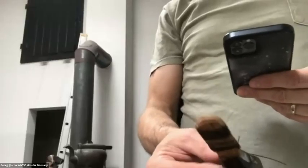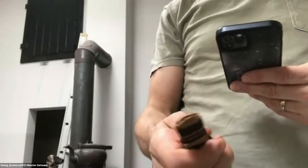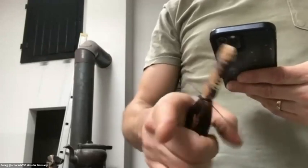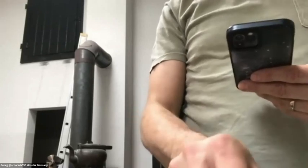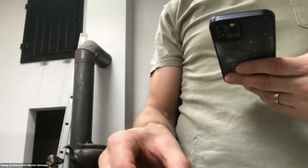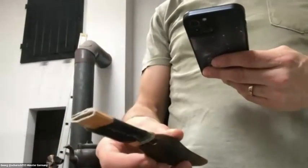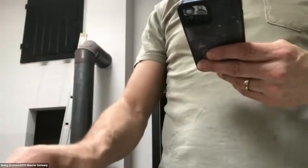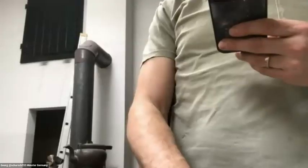This is a handle, for example, which is really asymmetric, but I took this piece of wood in my hand and thought, okay, here I usually have my thumb, so I just cut away this, and when I hold it like this, my hand fits in like that. So it's sort of an ugly looking handle, but it's actually quite comfortable. Then I played around with a Mora style octagonal one. Here another octagonal one with birch bark, and another whale shape. I just try to play around with a lot of variations and find out what I like. These are pretty much the sloyd handles I have here to show.